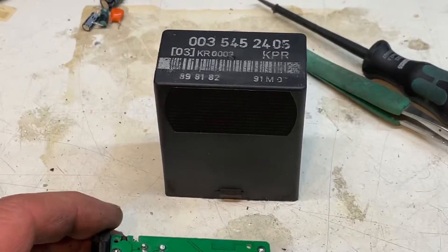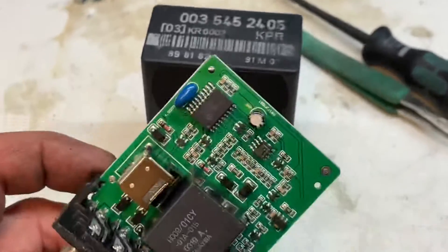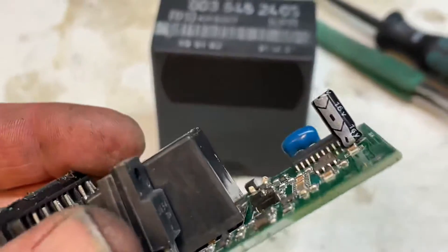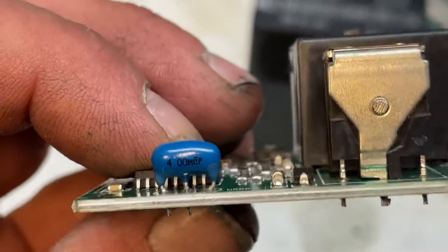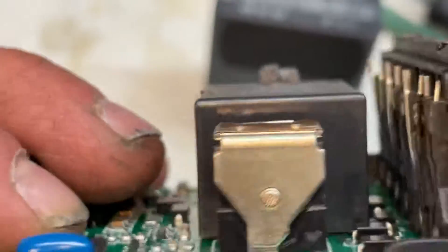This is what I'm seeing with these cars, even with these modules when they are coming in. This blue thing you're seeing here is the actual clock for the microcontroller. Let me see how many megahertz we've got — four megahertz. You can read it right there: it's a four megahertz clock.